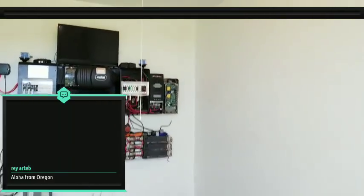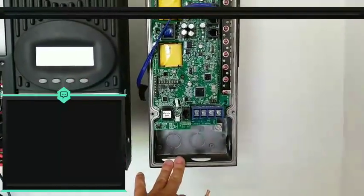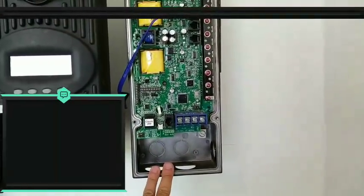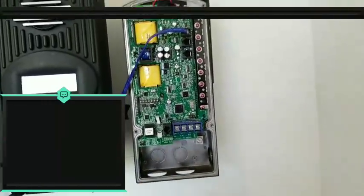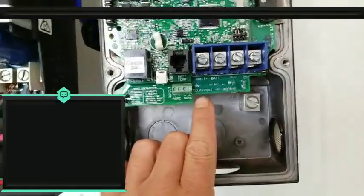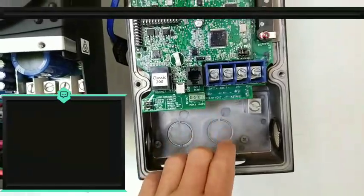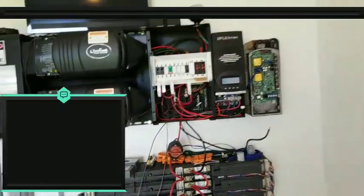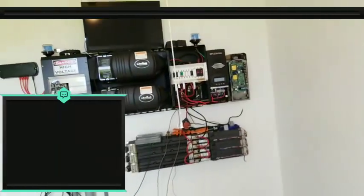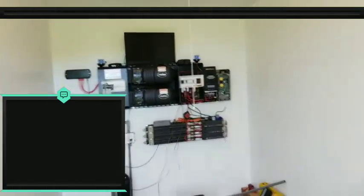In the owner's manual, it helps if people are unfamiliar with how to energize your relays. You go into your diversion, and there are lots of options on how you can pick it. You can even see right here, like relay out, auxiliary two, auxiliary one, in and out. That would be where you're tying in, basically sending a signal to your solid state relay to turn on or turn off at the moment. So it doesn't have to be very thick wires. It's just sending a signal saying okay, on. Okay, off.